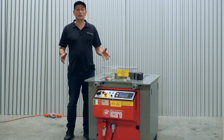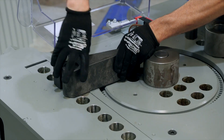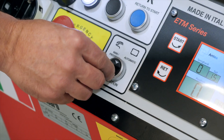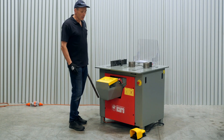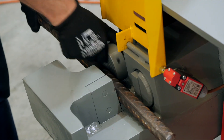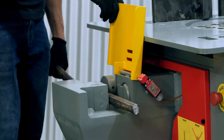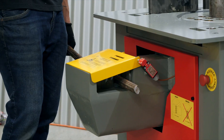As this is a combined cutting and bending machine, I'll quickly take you through the cutting operation. The first thing you need to do for safety is remove the bending bush, the squaring arm, and the bending angle pin from the machine. Switch the machine to manual and relocate the foot pedal to the cutting station. Open the safety guard, place the bar into the machine, and adjust the rear support to the thickness of the bar — this stops the bar from deflecting while the blades are shearing. Close the guard, make sure the top guard is closed, and then commence cutting by pressing down the foot pedal.